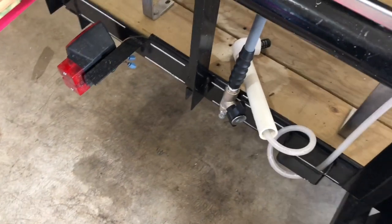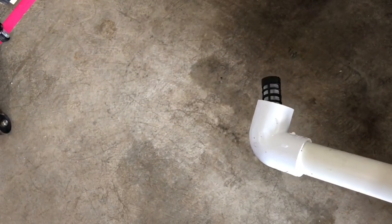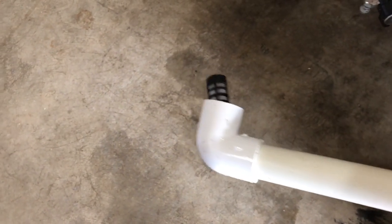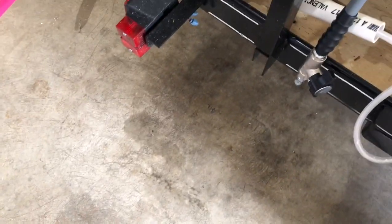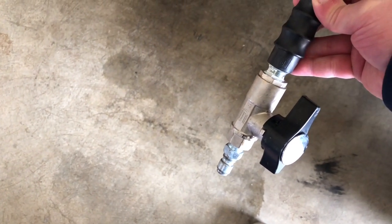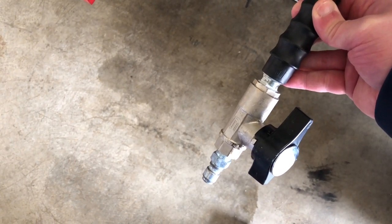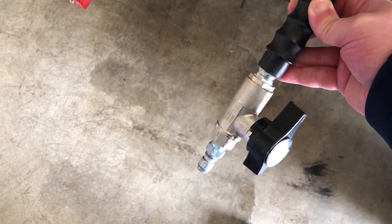This was set up for a smaller job we just did. You just take this drop stick and drop it right into the five-gallon bucket. Got a piece of PVC here that kind of holds it down in the bucket so it doesn't float to the top. When you're done you just pop it back wherever you want to put it. At the end of this high-pressure hose we have a ball valve — this thing has been really handy. If you want to switch between your guns or surface cleaners or anything like that, just turn it off, unhook, and plug in your gun or your surface cleaner. Really, really handy — if you don't have one on the end of your pressure hose, get one.